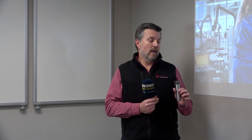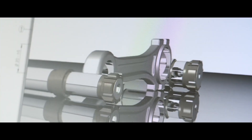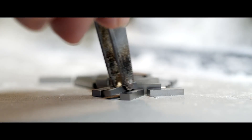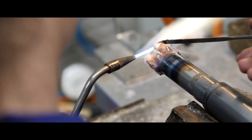The nice thing is Diatool is very good at reconditioning these reamers to as good as new — it's not something you throw away. We can re-grind them, but when we truly re-tip the reamer, put brand new blades on the reamer, it's as good as new. Tool life will always be the same whether it's new or re-tipped, and we do not put a limit on the number of re-tips. We'll re-tip it as long as the body is in good condition. So re-tipping means reusing the body of the tool and just adding new edges — correct. That's a cost savings for the customer, as they can re-tip over and over again for the lifetime of the body.